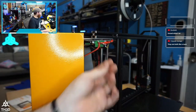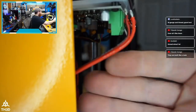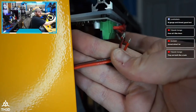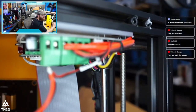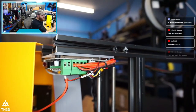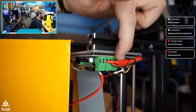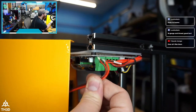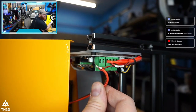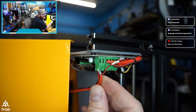We have 18-gauge wire feeding the control board and 15-gauge to the bed. You're not gaining any benefit from that 15-gauge wire — you're choking out the machine's heat-up time. And we also have tinned wires. That's a separate issue. There's also a fan 24V wire tied into here, which is fine. But the tinned wires and the gauge difference together — this is unacceptable.